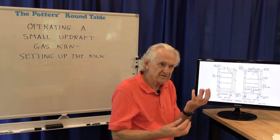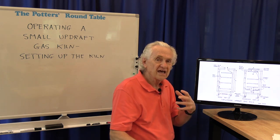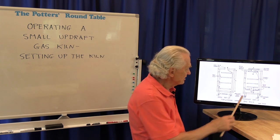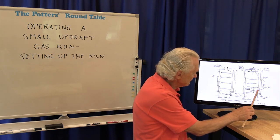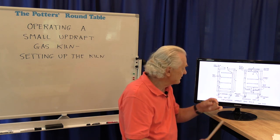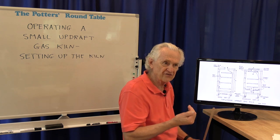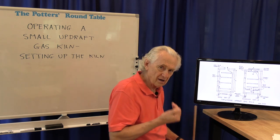And the idea is that when the flame hits the kiln post, it disperses the flame and causes turbulence and causes it to mix with the air better. So I have 5 of these posts, since there are 5 burners. Over each post, there's a burner that's sticking out. It doesn't completely touch the wall. I had to play with that spacing also. How far does the end of the post come to the wall?